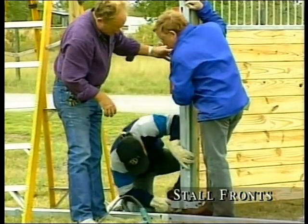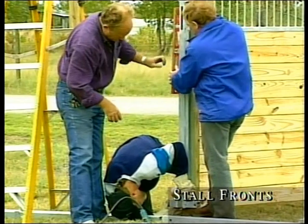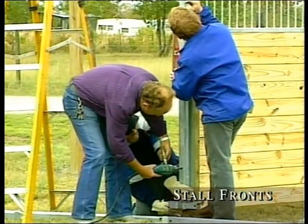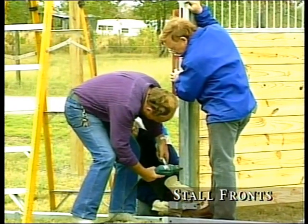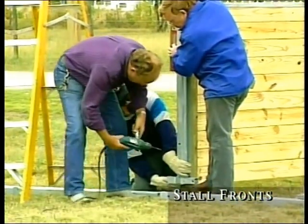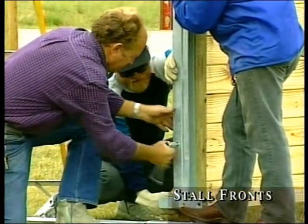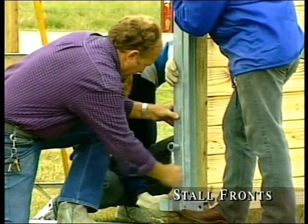Draw a line parallel to the bottom of the first board, which must be even with the top of the bottom bolting insert. Once you have drawn your reference line on the side and front of the wooden center post, you are ready to stand the middle post and secure it to the outside of your stall. Stand it, raise it to the reference line, and level it to the top of the bottom bolting pin. To prevent splitting your wooden post, drill a pilot hole before securing the channel. Use a half-inch by 4-inch lag bolt to secure your post, then repeat these steps to secure the top.